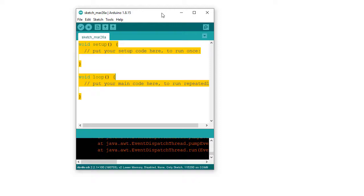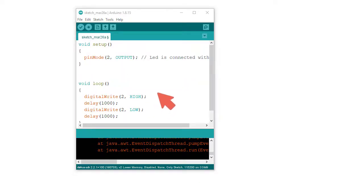Now I will use a code to blink the LED. This is a simple LED blink code. The LED is connected at GPIO2. In the setup function we define the pin as output: pinMode(2, OUTPUT) — 2 is GPIO2 pin number. In the loop function, the first instruction is digitalWrite(2, HIGH), meaning GPIO2 will be logic high and the LED will glow. Then a 1 second delay. Then the pin goes logic low and the LED turns off. Then another 1 second delay, and the loop continues. The LED will turn on and off with an interval of 1 second.